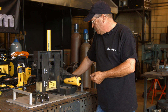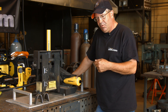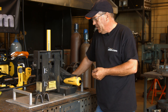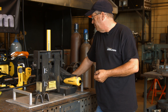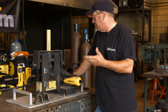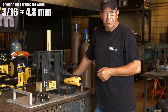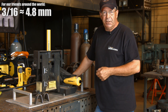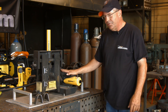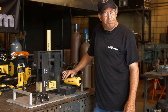Not much of a groove, very slight weave on the cap. A little experiment — I'm playing with this machine and getting to know the numbers. I see some project work coming up with it. So there you go: a little bend test on some 3/16" material uphill. That's your demo. I hope this helps. Please subscribe to the videos. Thanks for watching.